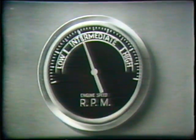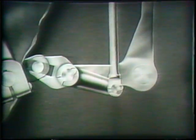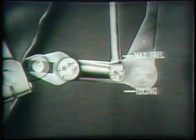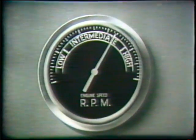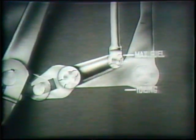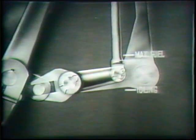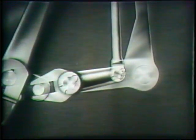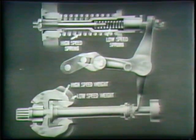If the engine speed drops below idling speed, the bell crank of the governor moves the differential lever to an increased fuel position. The automatic action of the governor in this way controls the idling speed of the engine. If the engine tends to overspeed, the governor bell crank moves the differential lever to a decreased fuel position, thereby automatically limiting the maximum speed of the engine.